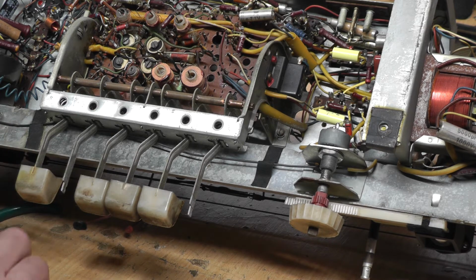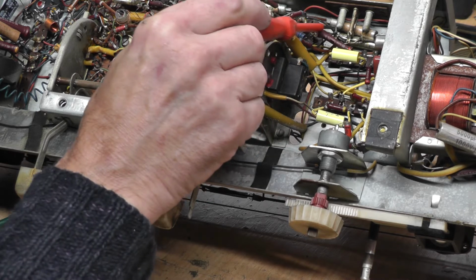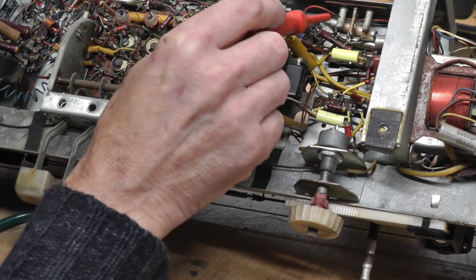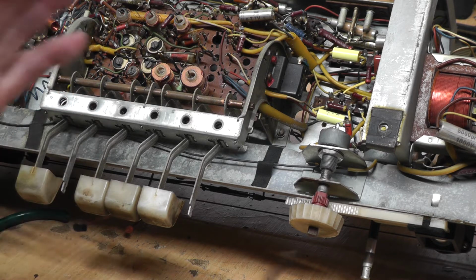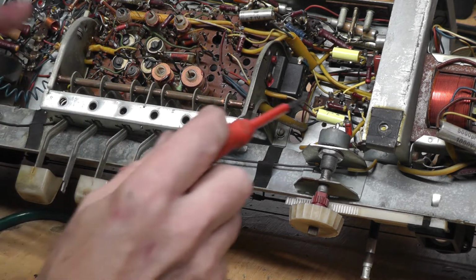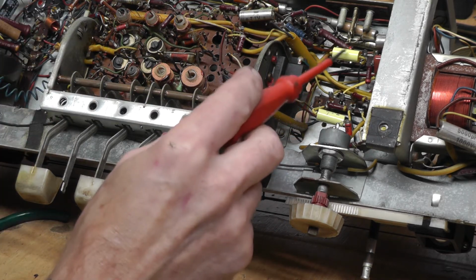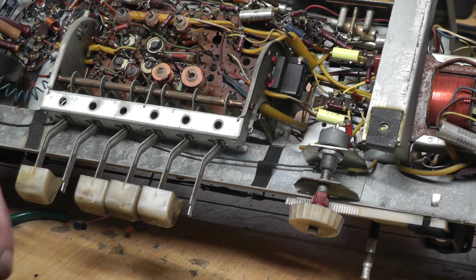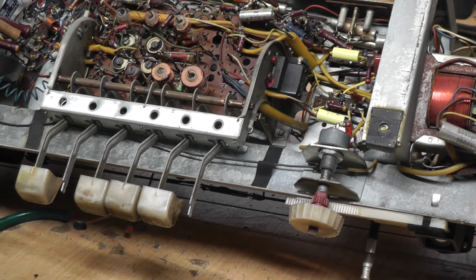Perhaps eventually, when I come up to this area, we've got some old electrolytics which I think I shall replace. I haven't bought anything, I have to say. I'm not spending any money on this set. I had the polypropylene capacitors, rated above the old ones that I'm taking out in voltage ratings. I'd got all this, and I'd got the can smoothing capacitor, so it's just a little bit of fun to see if I can make this set work.